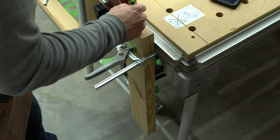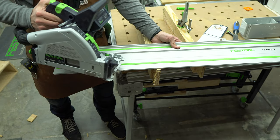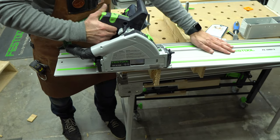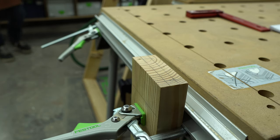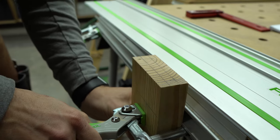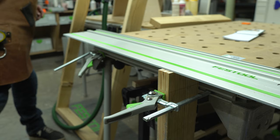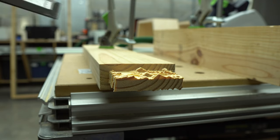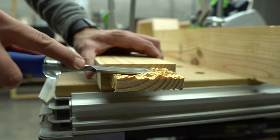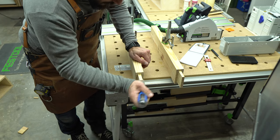The cross cut section is more suitable for shorter pieces, while the repeat kerf cut is better suited for cutting tenons on long boards held against a flat surface. The cross cut section is certainly the quickest and cleanest method for cutting tenons, however it requires additional tools like clamps and a work surface with a right angle to hold your piece in place. The repeat kerf cut method takes longer and leaves a rougher surface requiring clean-up, however this is a more minimal approach to cutting tenons.